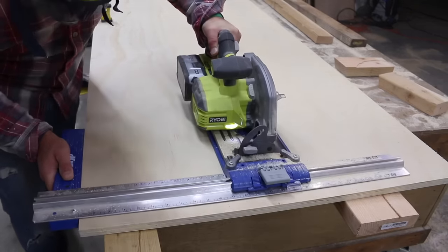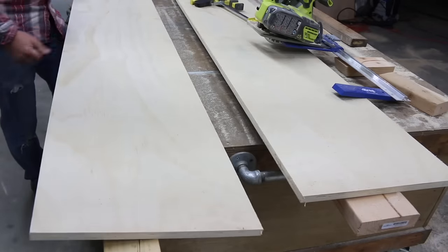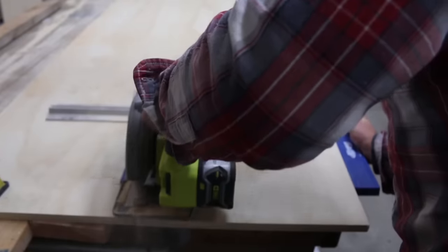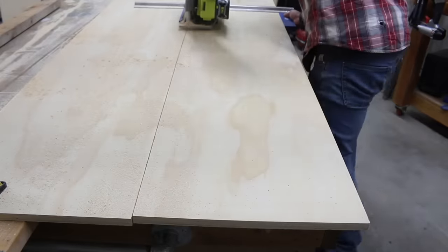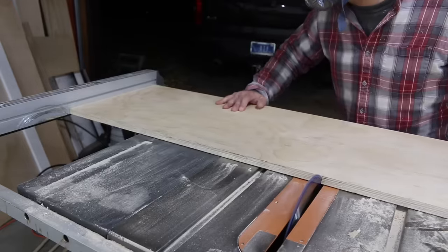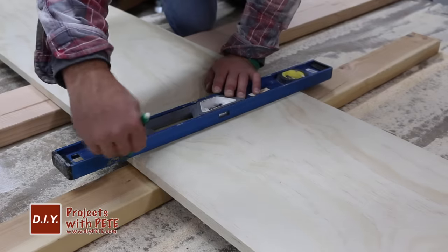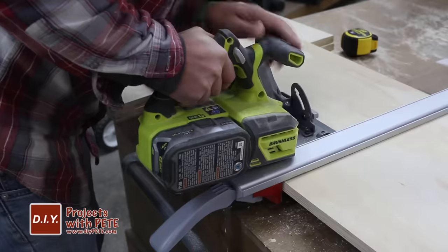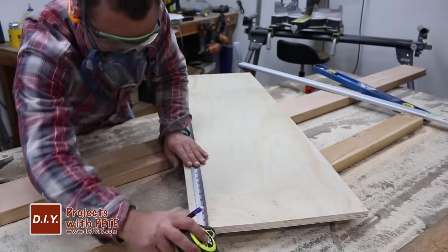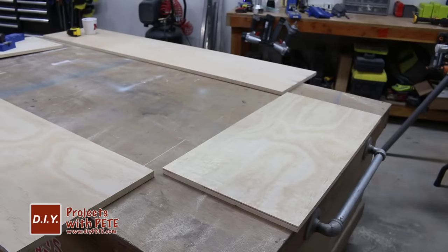I made the unit and shelves 15 and three-quarter inches in depth, which is plenty deep for all sorts of clothing and storage. This build can be completed without a table saw, but if you have one you'll be able to speed up the process. I actually prefer using a table saw once the plywood is a bit more manageable in size, but you don't have to have one. The plans have diagrams showing the most efficient ways to make your cuts — you can find them in the link in the description below. It never hurts to double-check your measurements with a tape and a speed square to ensure everything will go together like it should.